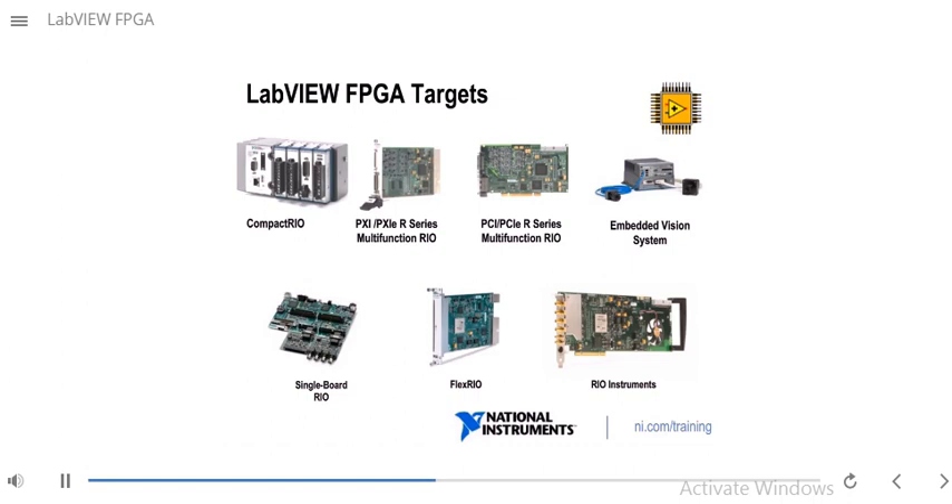At the middle bottom, you see the FlexRIO. The FlexRIO product family provides flexible, customizable I/O. FlexRIO instruments consist of FPGA boards and adapter modules that provide high-performance analog and digital I/O. The adapter modules are interchangeable and define the I/O that's available. This LabVIEW FPGA course focuses on programming techniques for Compact RIO, Single Board RIO, and R-series applications. If you are using FlexRIO, you will typically need additional learning beyond this course due to the much faster I/O rates. FlexRIO techniques are covered in the high-throughput LabVIEW FPGA course and FlexRIO course.